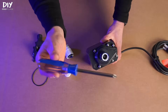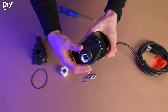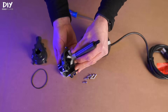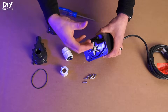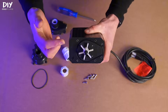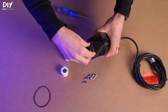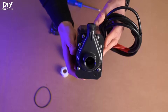To replace the face plate, take a Phillips screwdriver and unscrew it from the pump. Once you have all the screws loosened, gently wiggle and take off the face plate — most times your pump impeller is going to come with it. Grab onto it and gently pull it out. Once removed, slide it back into place — it's all magnetic so it will pull the part into position. Next, inspect the rubber ring to make sure it's not kinked or damaged; if it is, take your replacement and swap it out. Then take the replacement face plate, gently press it into place, and reattach using those same screws. Your pump is as good as new.